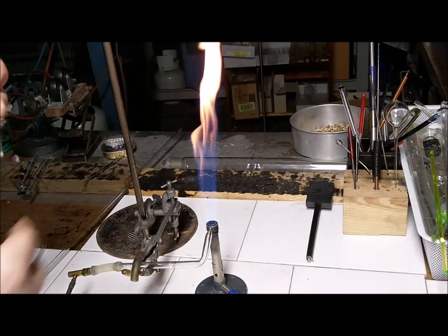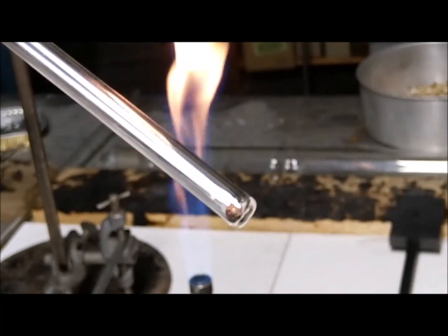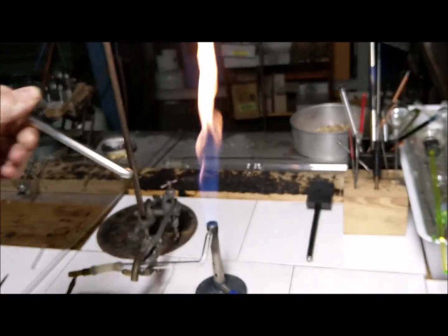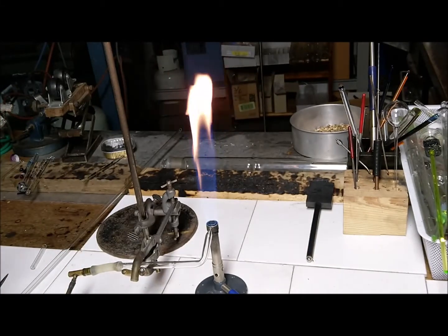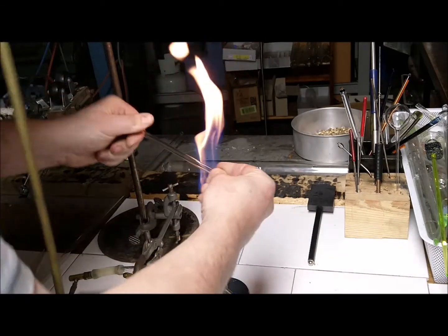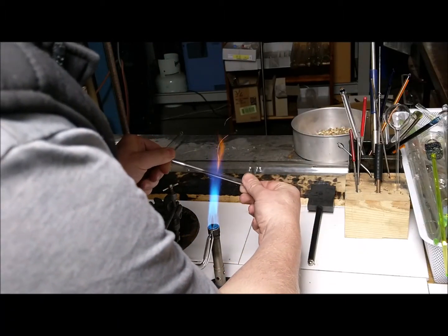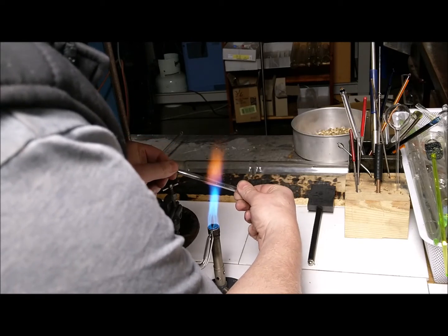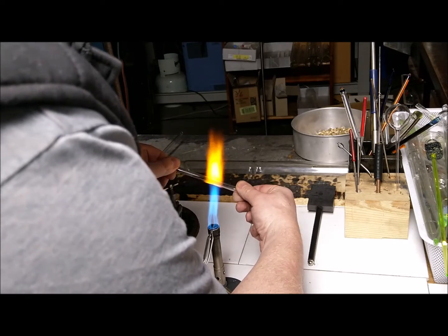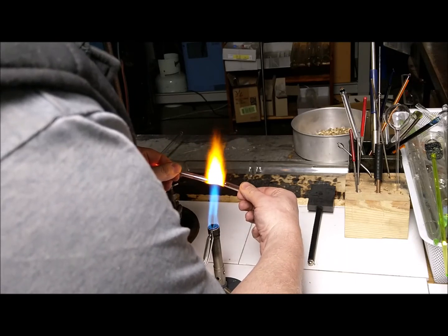This is the final step where we've sealed a little bit of something into the base of our ampoule — I've just put a few bits of metal in here. Let's say we're going to seal the top of that to make a proper sealed ampoule. Get yourself into position and find a spot that's not going to burn your fingers. Just rotate backwards and forwards slowly as you blow, heat that zone up. Once it starts to really get hot, you can start to pull slowly while you're twisting and that'll keep the whole thing centred.